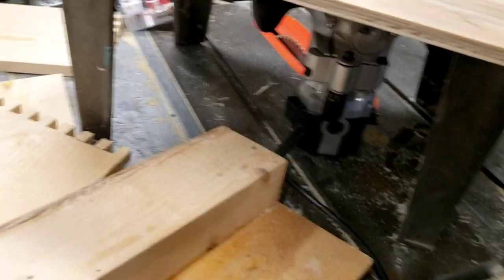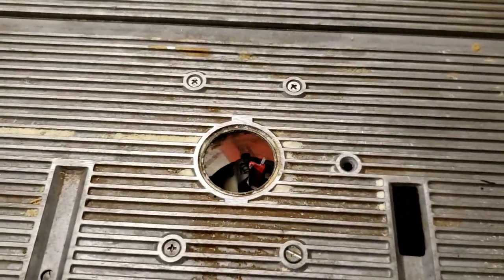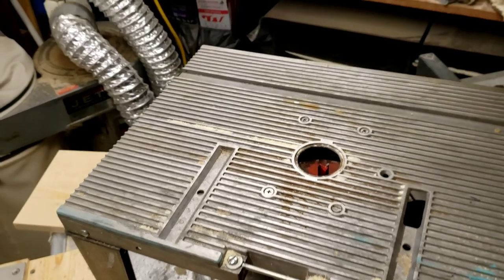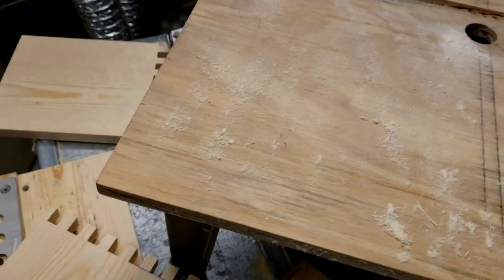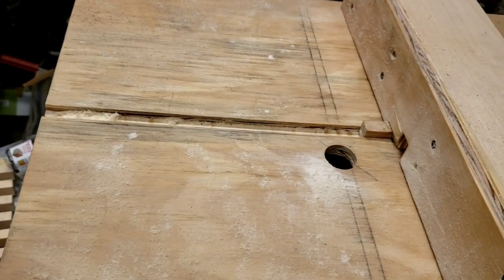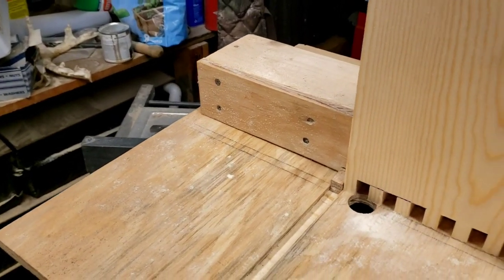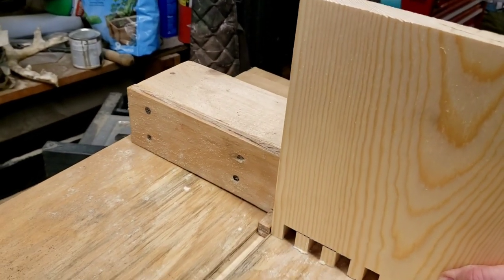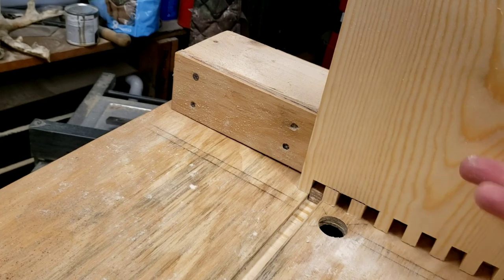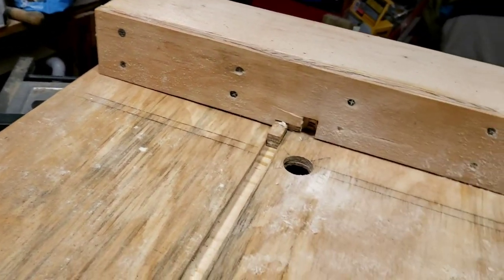If you're interested to see my previous setup: this is a router with a bit mounted to the router table. You put this board with guide over the router hole, then you take this homemade sled and position it just behind where the router bit would stick through. You'd take your box board, stand it vertical, slide the unit over the router bit and back through, then move it over one onto the finger and run it through, continuing to move it over and back through.